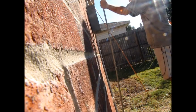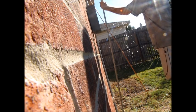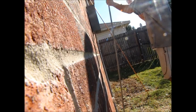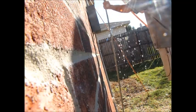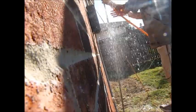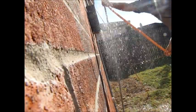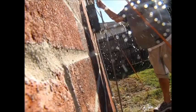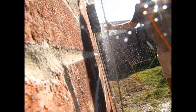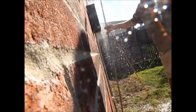Then you kind of go up and down with it like this. Now this takes about 15 to 20 minutes. There's going to be rocks and some stuff in the way that's kind of hard to get through and around, but you've got to just persevere and get through it. You have to try to ram it down as hard as you can, then lift it up to let some of the sediment clear out, and ram it down again — just keep doing that over and over.